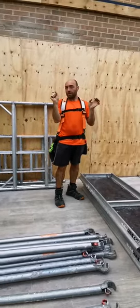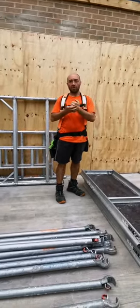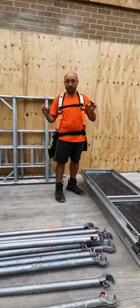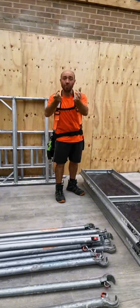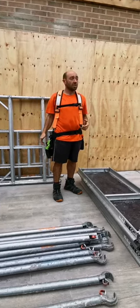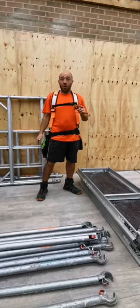Setting out the Veluxes, I always allow 10mm either side. But Scott from SM2 has just given me a good bit of information that a lot of the Veluxes coming out now have 50mm Celotex all the way round. A lot of people getting caught out, having to put it in and then plaster goes into the glass. Find out first.